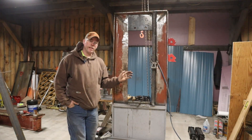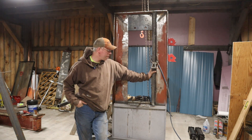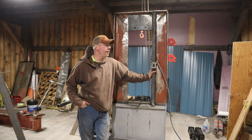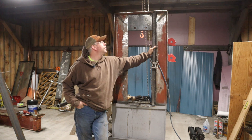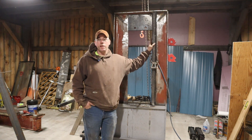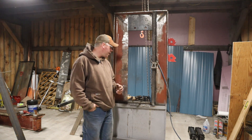I'm trying my hand at vertical welding. A viewer suggested switching to the 7014 rod, so I picked up some 5/32nds today — grabbed the wrong box, always in a hurry, but got 10 pounds of it. I am highly impressed. It took me a little bit to get the hang of it — definitely a rod that likes to be perfectly perpendicular to the work — but we're getting some pretty nice beads and good penetration. The bigger rods go a lot longer for me than the 1/8-inch rods.